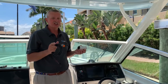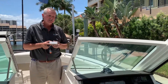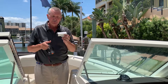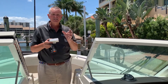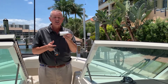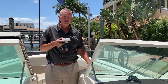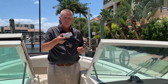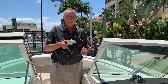For this installation on this Boston Whaler, I found an ideal spot right up here. I tested it earlier to make sure we don't have any disturbers or electrical noise giving us false signals. Also be careful to keep the unit away from cup holders, because people tend to put their cell phone in a cup holder, which generates electrical noise and can cause false triggering of the detector. I found a great spot right in front of the windshield — it's also a very short cable run from the indicator up to the remote housing, and easy access for the electrical power.